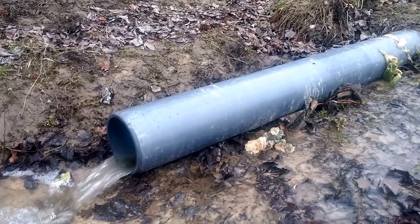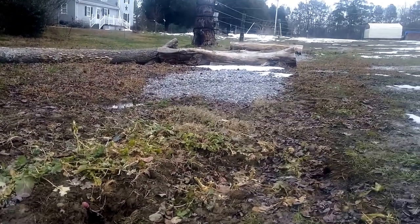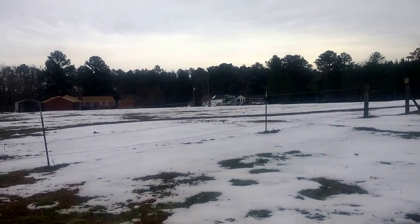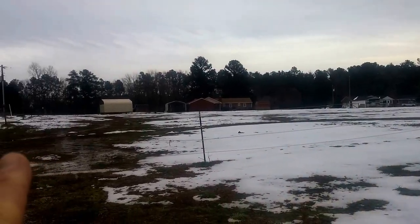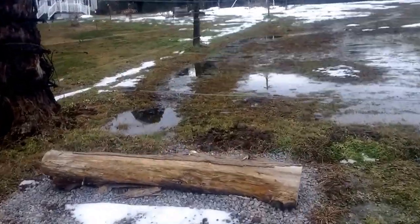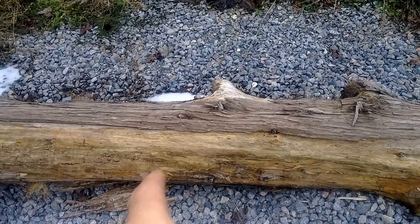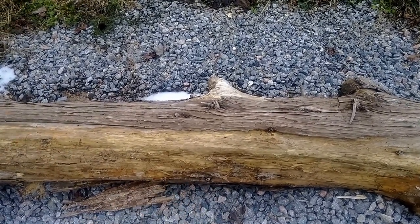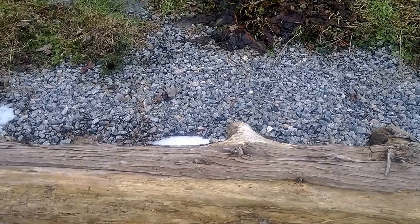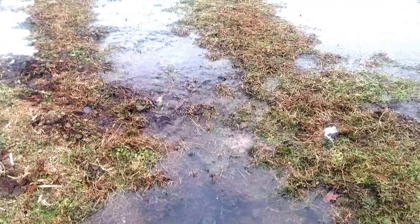This is a drainage pipe that I installed last summer. It's designed to pick up whatever ground runoff occurs from this pasture across here, and all that water will travel down right to this corner. I've dug in probably 36 inches deep right here on that side of the log and filled it in with gravel, then started my pipe right here with a little mesh on the end — a half-inch by half-inch wire cloth.